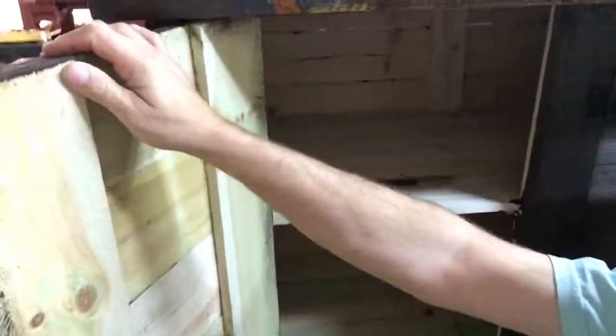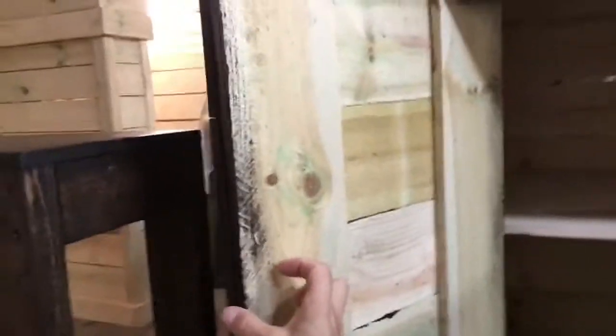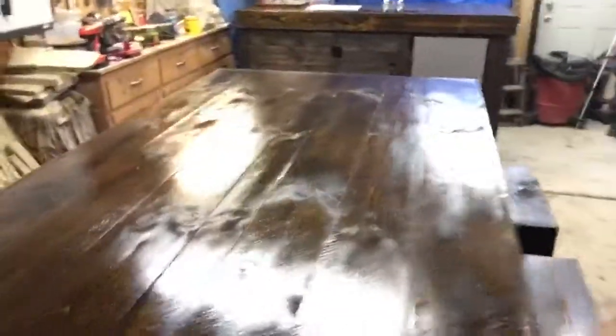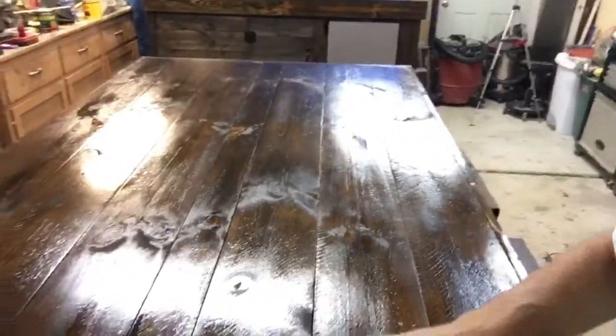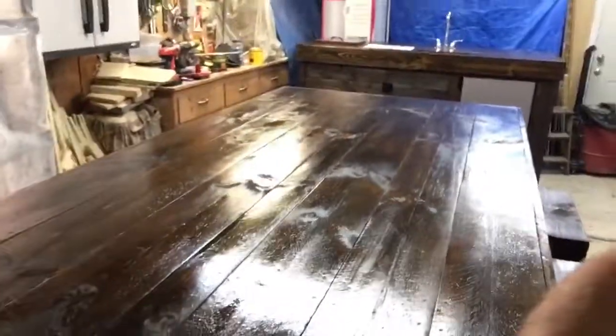And then you guys know when I make my doors, I always use these. I've actually widened the planks that I use, so this way it stops them from warping, because I used to go half as thick. I don't do that anymore because if you don't get the wood when it's really dry, it has a tendency to kind of take its own shape. So here's the top of it, all real nice and shiny. I use an outdoor clear on it, so this way it's more durable and it gives it a better shine faster. You don't have to put as many coats.